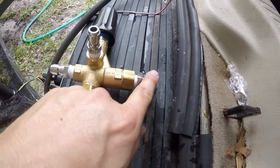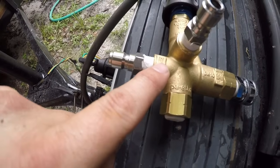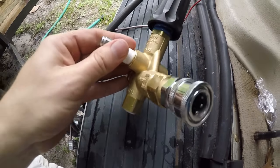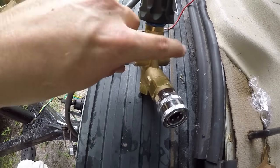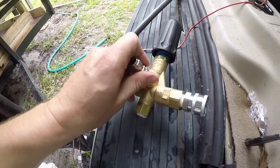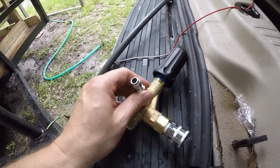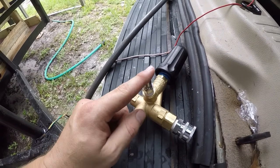This one is your out — it says right on there 'out' — and this one says 'in,' so this plugs into your pressure washer and this is where your hose plugs in. This T-fitting here — you can put it on either side, just take the allen key out — and this is where the water will dump out. It'll blow that water on the ground or back into your tank wherever you have it routed. When you let off the trigger it dumps; when you push the trigger there shouldn't be any water coming out.